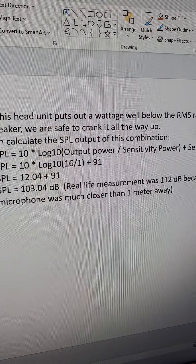We got 112 decibels. Why do we get 112 and not 103? We got 112 because the microphone is much closer to the speaker than one meter — it is approximately one third of the distance away. If we were to do this test again and raise the microphone up to one meter it will be about the same. Let's do that right now.